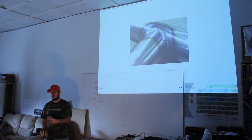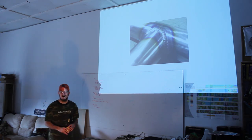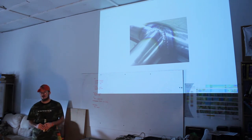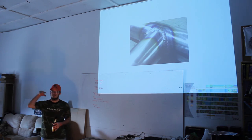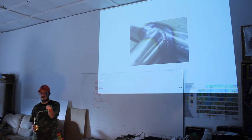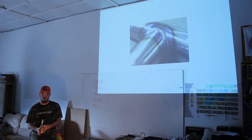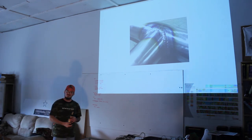I kind of remember that from class 25 years ago. Remember the scary pops? And you had the handle on the cutting torch? So you heat it up first, and the handle feeds a higher proportion of oxygen. The oxygen that actually cuts it comes from that. The oxygen mix makes a flame that heats it up, and then you blast it with more oxygen. I remember the tip would get shaky and then you dip the tip in, and it goes bang. Exactly right. The first time I was jumping like 5 feet in the air.